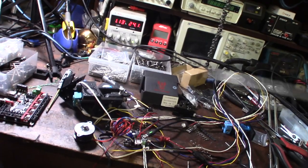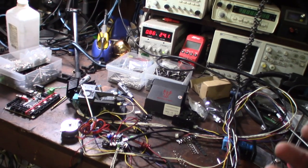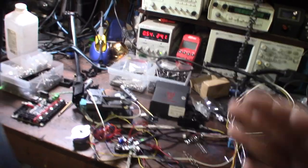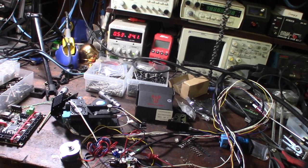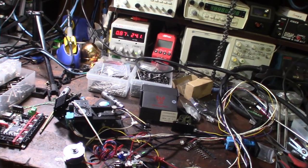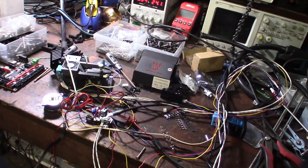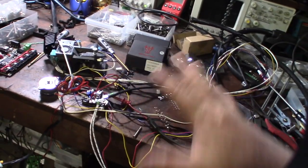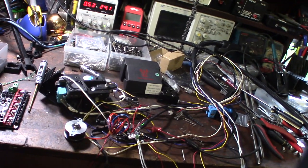Having to wire in some external adapter with extra wires makes everything more complicated than it needs to be, especially for troubleshooting. If you're running CAN in bridge mode behind the Raspberry Pi on something like the SKR Pico's UART pins, troubleshooting that would be a nightmare. With USB, if I'm not communicating with the MCU I know it's the USB cable or a connection problem. Maybe once I upgrade to a better board I'll mess around with CAN.